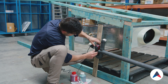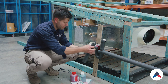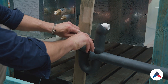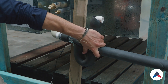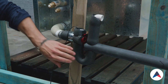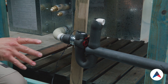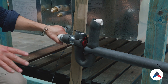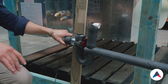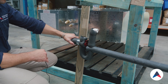Pull that insulation down through there. I might put another little piece of insulation on the top there to finish it off. Next, we just need to tape all this together so we have no conduit exposed — it's completely insulated all the way around. Because we're up inside a roof cavity, the roof cavity is probably going to be 50 or 60 degrees, and the water coming out of the air conditioner is probably around five degrees, which is going to cause a lot of condensation. So it's very important that we insulate as much as possible. I'll tape up all these joints and close all that up, and then we'll go on to how we wire the float switch in.